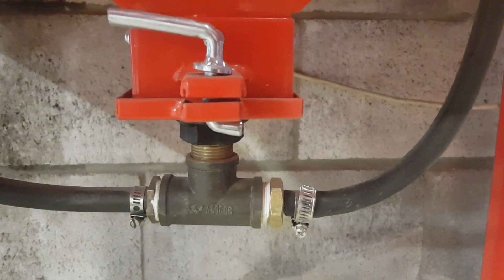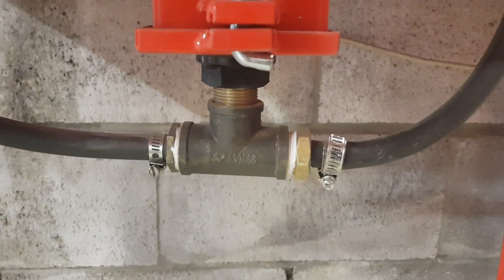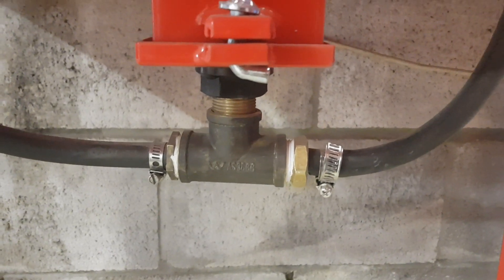It doesn't have to be a full blown air jet. If you did have too much air coming through it'd probably wear this hose out pretty quickly. So this valve is just enough to drop the flow of the air down so it doesn't blast the hole on the inside, and it's just enough to help draw that sand through and up through the pipe to the nozzle. Unfortunately I don't have time to pull this apart and show it today, but hopefully that answers the questions. Cheers.